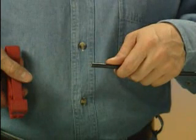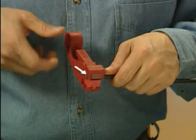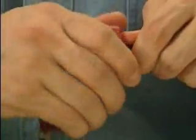To operate the SDT, place the correct model onto the drop cable end and align the end of the cable with the edge of the tool jaw as indicated by the arrow on the bottom. While holding the cable close to the tool, slowly rotate the tool away from you around the cable for 3 to 5 revolutions, or until you can no longer hear the braid being cut.